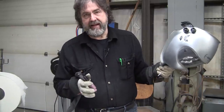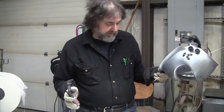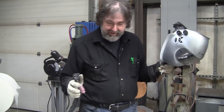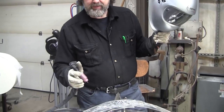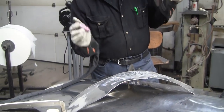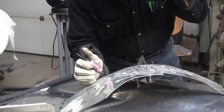If you have acetylene set up in your two-car garage, your wife is going to be worried about that leaking all the time. That said, you should really have a welding torch in your shop because you really need one for loosening bolts and stuff and bending things. So I'm going to burn this tungsten in, and that'll create the little ball. It only takes a minute or so.